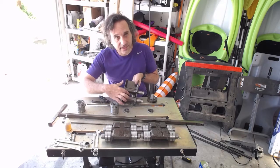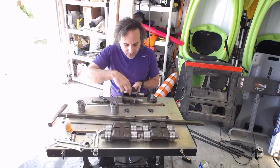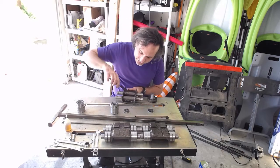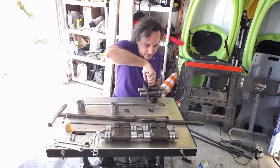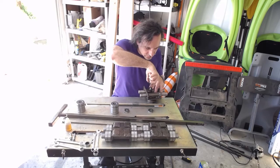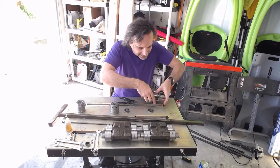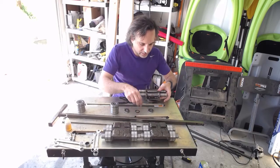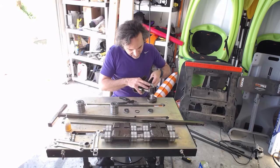The two axles of the wheels are actually getting in the way of me being able to slip in the washer and the snap ring. They won't fit this way — I need to put them sideways. So I'm going to have them in place and hopefully slide all of this while the snap ring is wide open. This washer is a bit of a tight squeeze. Since they weren't all built to the exact same tolerance, I might just find one that's just a tiny bit looser so it'll go on easier.